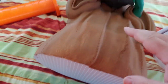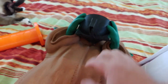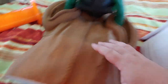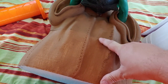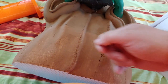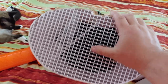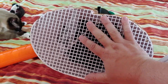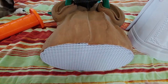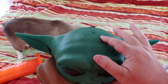Actually, this wasn't the roll falling off — I had to switch color. So this part's black and this part's white, as you can see. I ran out of the white, so I switched to black. I goofed up the switch and ended up printing two separate pieces. This one's all thin — two perimeters and no infill. Just a little bit of infill on the bottom, which gives structural integrity, a flat surface to sit on, and keeps the shape from warping. The rest is basically hollow. I turned on infill at the top to make sure the top of the head would close properly.